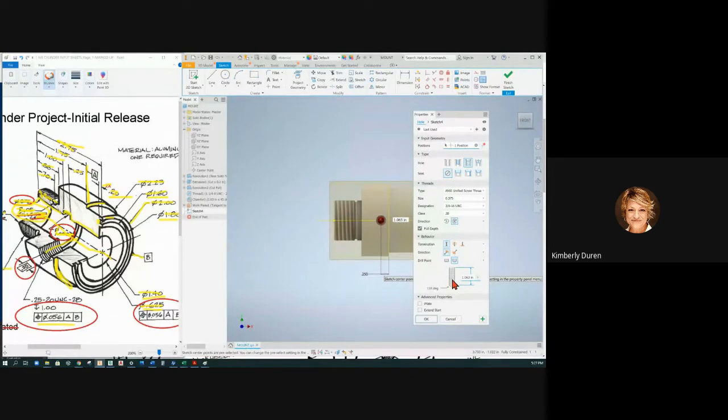Whenever you cut threads on things, it pushes all the shavings down to the bottom and it makes it gall up. But when you tap it from the bottom out, it won't do that. And this is 1 inch deep. It is 1/4 or 0.25, 20 UNC 2B, and it has a depth of 1.